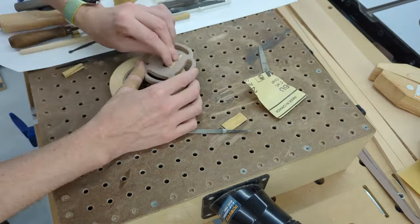Making the saya will be a two-part process. First, I'll glue the blade offcuts to one side of the walnut that I just milled, using spring clamps as I did before. Since the blade needs to slide into this recess without any obstruction, I make sure to clean off any glue squeeze out before it has a chance to dry.